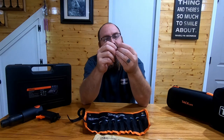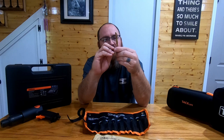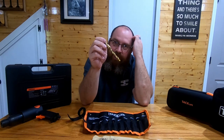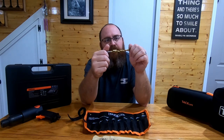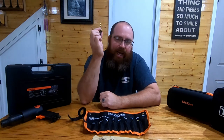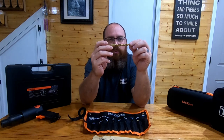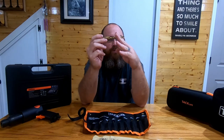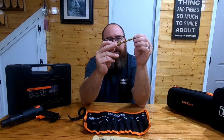We don't have to drill a hole as deep as the drill bit — that's another feature I like, the fact that they are adjustable. Now keep in mind, don't expect these to be high-speed metal drill bits that are gonna cut through titanium like butter. With any drill bit, if you're drilling metal you have to keep it lubricated to keep it cool — heat is a killer of the edge. If you're drilling wood, you don't want to hit screws as you drill in, because that's just gonna destroy the end of the bit by chewing on hardened metal, and that's not what they're designed for.